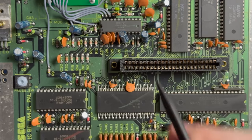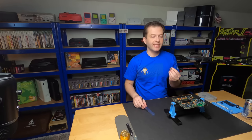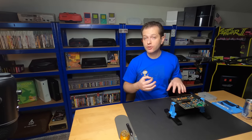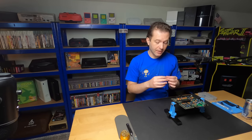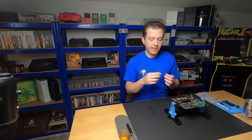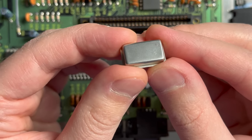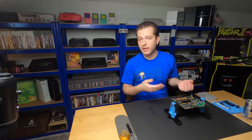That's the crystal right here. Thankfully both the RGB encoder and the video display processor have NTSC modes - we just need to activate them. To make this a faithful NTSC conversion I'm installing a true NTSC crystal. Most people doing a conversion like this would probably salvage an NTSC crystal from their Sega Genesis, and that'll work in the Master System just fine, but I don't want to sacrifice a working Genesis just to harvest its crystal. I reached out to Luke over at Console 5 and he offered to program one of these and send it over for me to test.